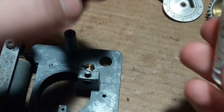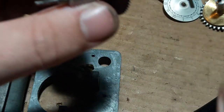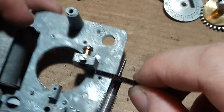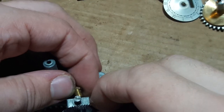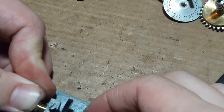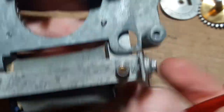I have also oiled up the actual teeth of the fibre wheel, because those go dry and crumbly. I'll also put a tiny bit of oil on here. And if I get it the right way around — yeah, this must be the right way around, because it will line up with the middle of the rotor. So this goes here. And I'll put this in here — this was all the way up against it, so I'll push it all the way in. This brass thing was very hard to take out, and now it's even harder to put back in again.